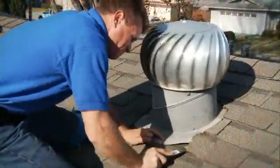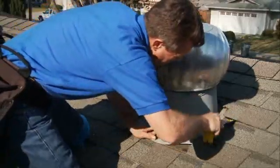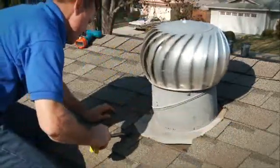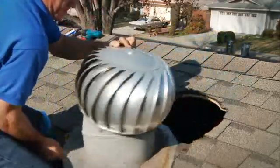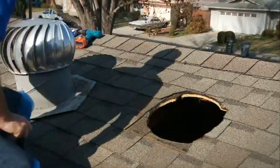To make sure you have proper intake ventilation and to maximize the solar fan's effectiveness, you should remove or block any static vents. If there is an existing turbine-type vent, simply remove the old vent and use the same hole for the new installation, or block it completely by sealing the opening in the attic space if possible.